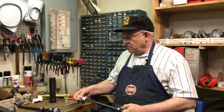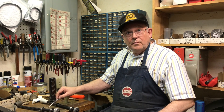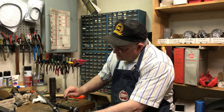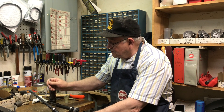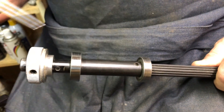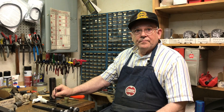This is a much more reliable configuration than the new two bearing quill, because right here, as you can see, they had to drill a hole into this shaft for this part, and it's a small hole, and then they pinned it. That weakens this area right in here and allows it to bend quite easily.